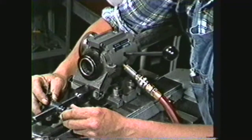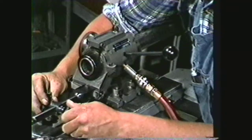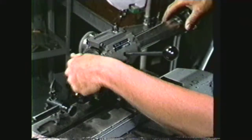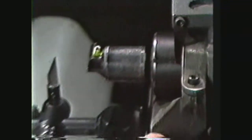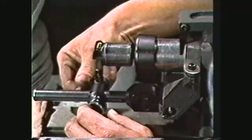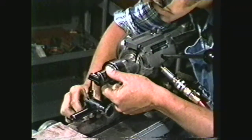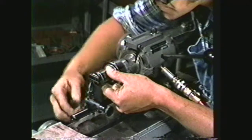The finger height is set using a centering level gauge or male center. Set the finger assembly close to the head for rigidity. Install a three-eighth inch collet and insert the gauge shank into the collet and tighten. The air bearing is locked down to a key device bolted to the fixture head. Move the air bearing spindle toward the finger and set it over and seat it home. If the bubble is not centered, loosen the set screws in the micrometer adjustment and then level the bubble. Tighten the set screws and recheck the bubble for level.